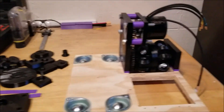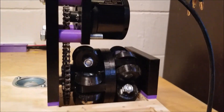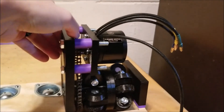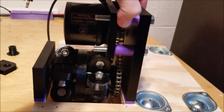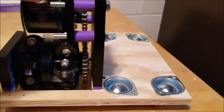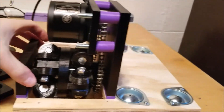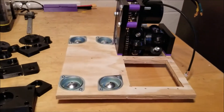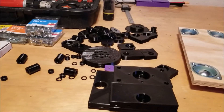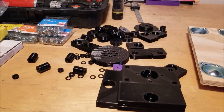Here's what it ended up looking like after I 3D printed all the parts and CNC'd the platform. You can see the omnidirectional wheel will be driven by the motor via the chain and sprockets. The ball transfer units are also screwed in. It will go forward and back and also left and right. That's what it looks like — the first half. Now I need to make the other half, and I have most of the parts already 3D printed and ready to go.